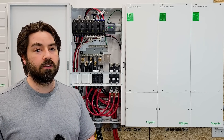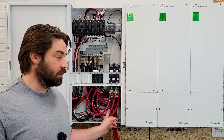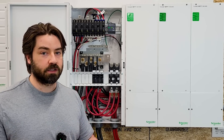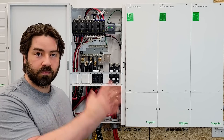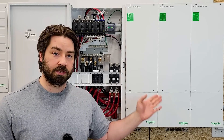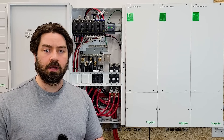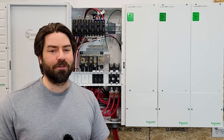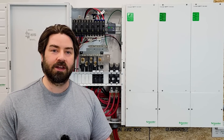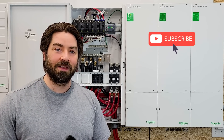Just make sure you're not using something like welding wire on the DC side — use UL-listed wire rated for 600 volts. I'll leave a link for the wire I use. Thank you everybody for watching. I did purchase the charge controllers from Signature Solar and will leave an affiliate link in the description along with a discount code. If you don't mind using that affiliate link, it really does help the channel. If you have any questions, please leave them in the comments below and I'll do my best to answer them. Thanks for watching.